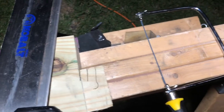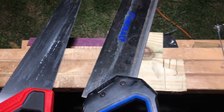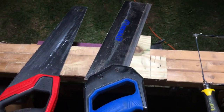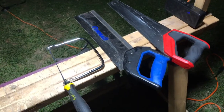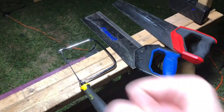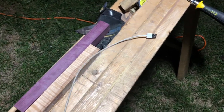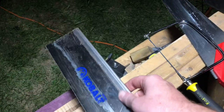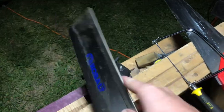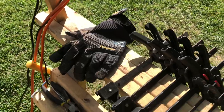Because of how flexible the coping saw is, it tends to be unreliable for a straight cut, which is why I go with the back saw. Disclaimer: these saws have different applications but operate the same way. When using a saw, put most of your force on the back pull rather than pushing it forward. The basic concept is that it's a lot easier to pull a rope than to push it. The back saw's reinforced spine makes it very good for pulling straight back and making precise cuts.